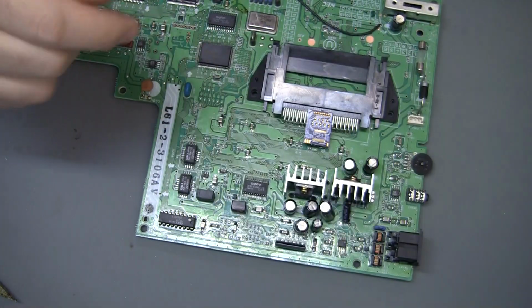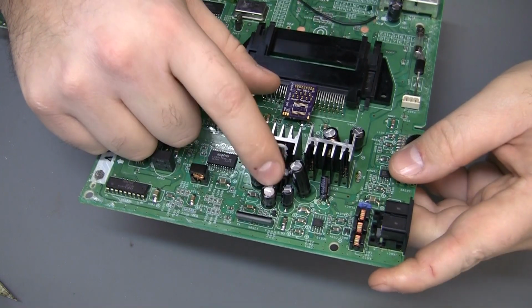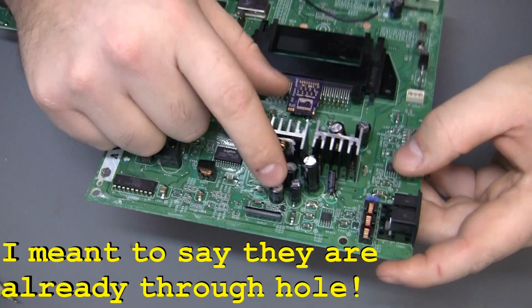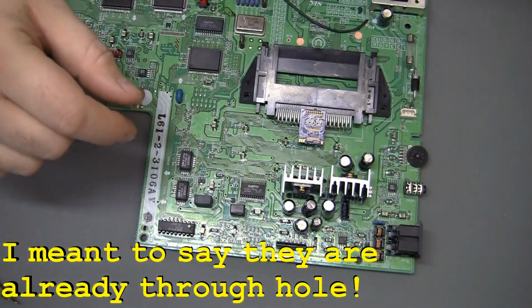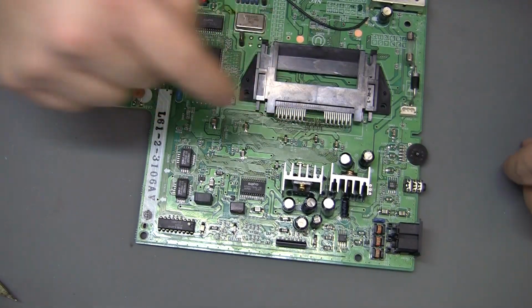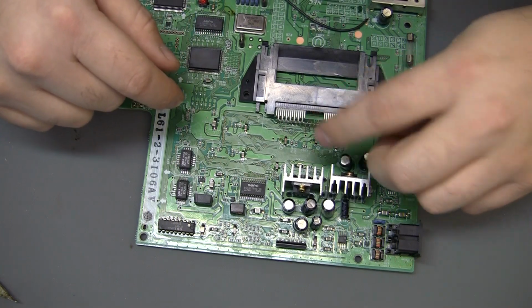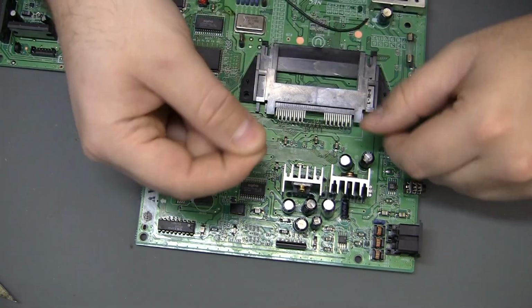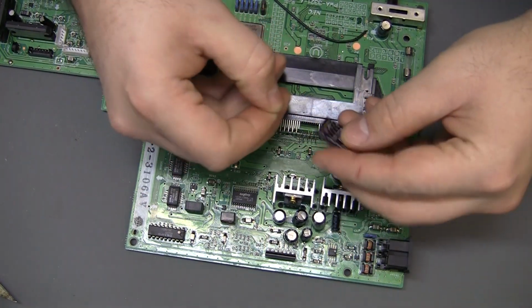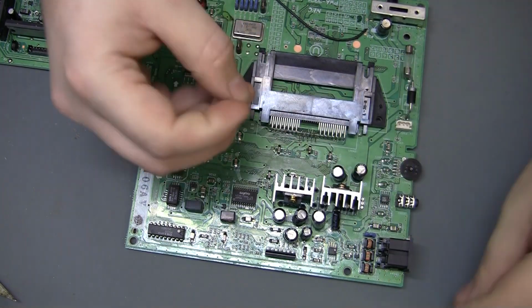Now on this mod, if you're doing the caps, you're going to have those legs from these caps, because these are so big you can't get them in ceramic, and you can just simply use those, and you'll just use 9 of them. And basically what we'll do is we'll heat up these legs that are still soldered to the motherboard, and it'd be best to clear out the hole first, probably, and then we'll solder in some straight pins, some long ones, and they'll actually just come up straight from where they were at and come right up to the circuit board.